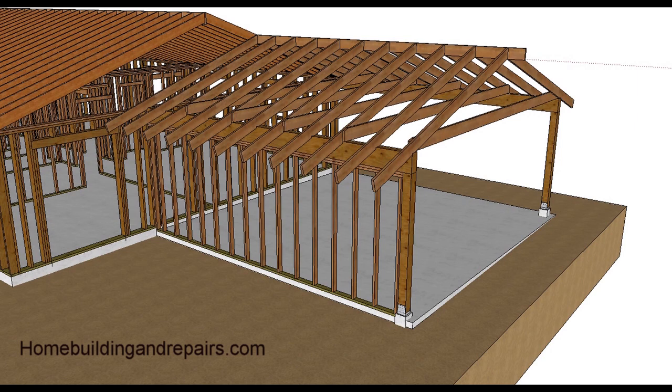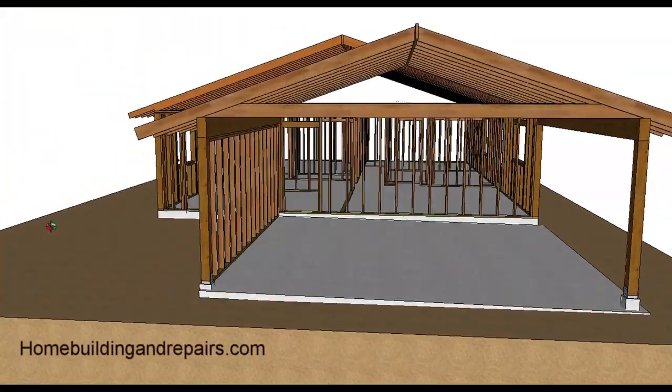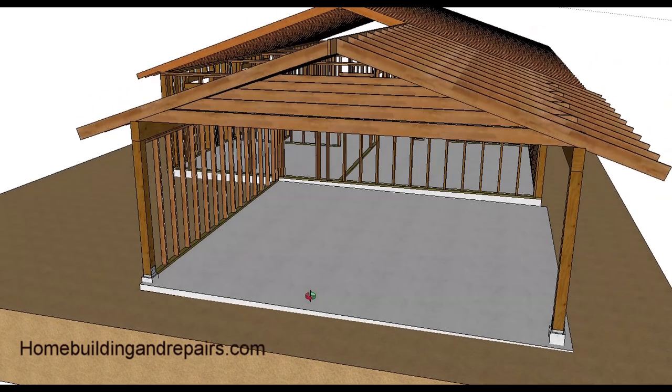Tip number three: a lot of people don't realize there's a step down into the garage. They might have a door from the inside of the house coming into the garage and they want to make it into one big room, leaving a step down. If you don't like the step down, sometimes you can just pour concrete right over the existing concrete to level everything out. But if you want it flat like the rest of the house, in some cases you might need to remove the slab and re-pour the whole concrete, and the foundation might need a new foundation.